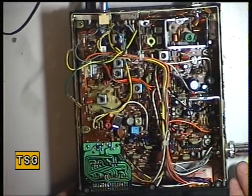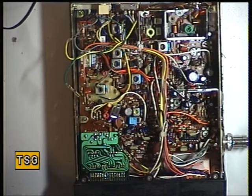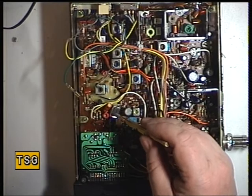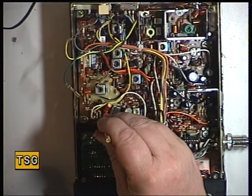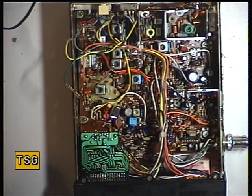Check the radio is on frequency. It should be 27.79125 MHz for channel 20, which I'm on. And what we have is 27.79116. So it's dropped very slightly, and that's absolutely normal as crystals age. So we use the red trimmer on the 10.424 MHz reference oscillator crystal. That's now 27.79124, so that's fine.